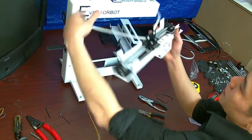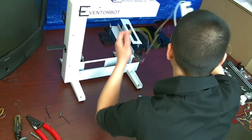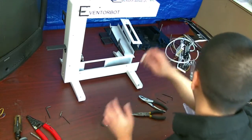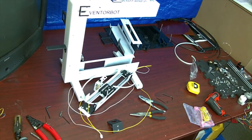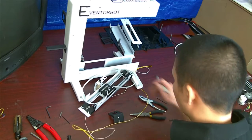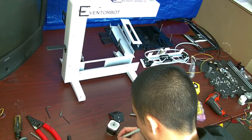That's what it's gonna look like, so the x-carriage is basically done right now. Let's put this aside and work on mounting the motor for the x-axis. The x motor is gonna have two pin nuts. I forgot to mark this — let me mark the momentary switch with an X and S so I know later that it's the x switch. And I'll write an X on the motor so I know it's the x motor.